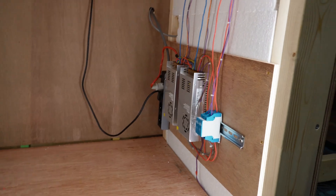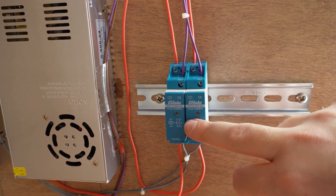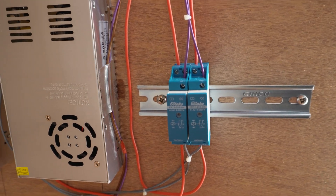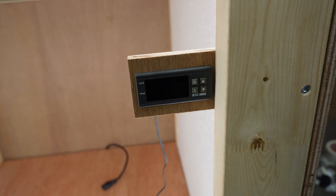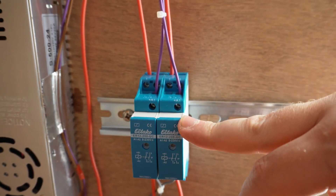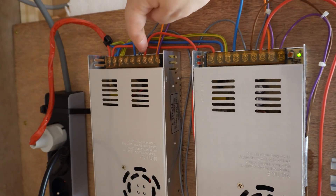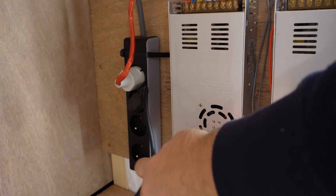Now it's time to explain the electrics that I did downstairs. It looks fairly complicated, but it's all fairly easy. First of all, we have these two relays — this is the relay for the top side heater, and this is the relay for the downside heater. The only reason I have this relay in here is that the relays inside of the controller are too weak to power the heaters. The heaters are about 12 amps and the controller only supports 10 amps. So if I do this too long, they will melt together and then you will have fire hazards. So these two wires are coming from the controller, just turning them on and off like they would do with the heaters — so instead of turning on the heaters, they are turning on these relays and these relays are turning on the heaters. Then we have the two power supplies, these are our bus bars over here — the positive side, the negative side, earth, and incoming wall socket power. Everything gets powered by this socket. This is the cable for my printer, and I have finished everything off with some aluminum tape.